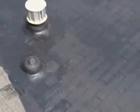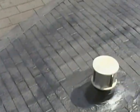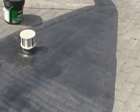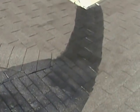We've got one coat applied to the flat roof area and brought it all the way down the valley to the gutter. This house has such a low pitch roof that from the ground you can't even see it, so no one would notice — but I thought it'd be a good idea to bring the coating down the valley too for extra security and better water flow. We've now got two coats on and it's looking pretty good — we're going to go ahead and call it a day. We may come back tomorrow and put another coat on after we let this cure out today.